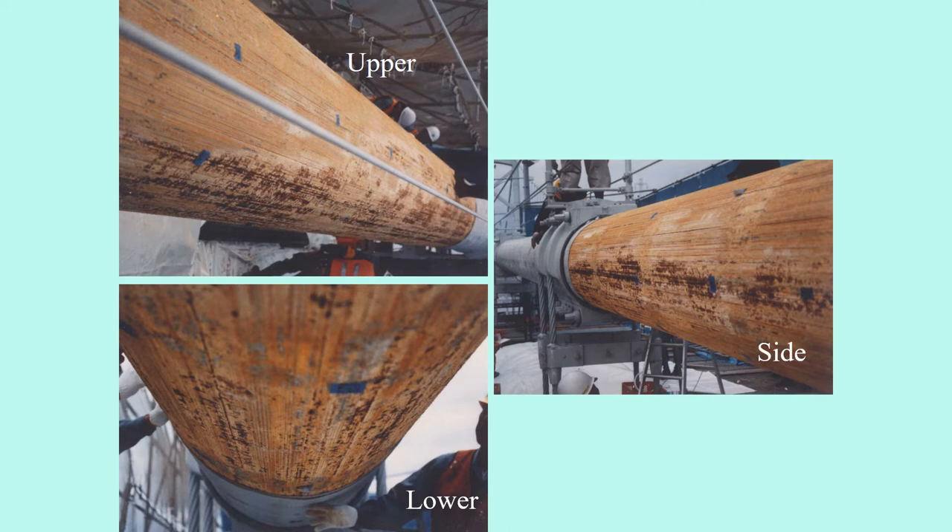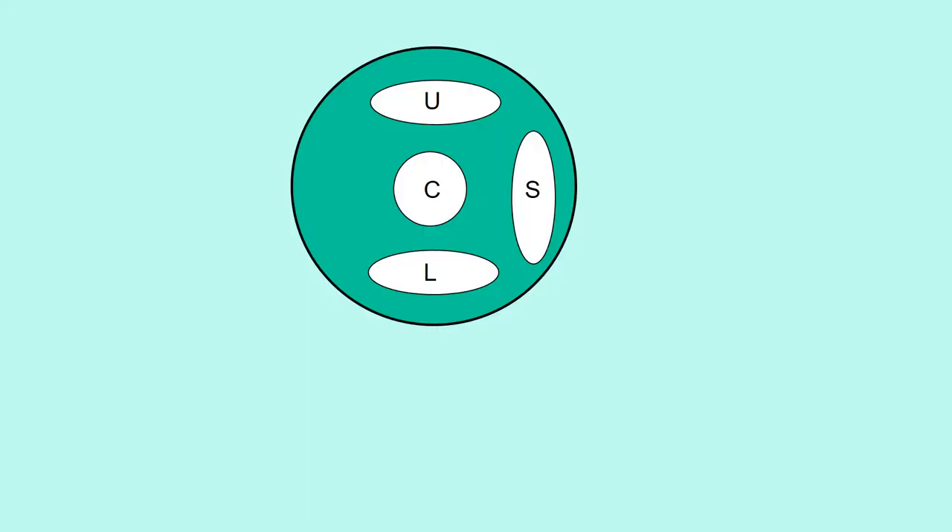This was our first question. We did lots of tests with small cable specimens, and also measured temperature and humidity inside the cables at site. When we unwrapped wires, water came out from the inside. So water exists inside, which makes the cable inside very humid.